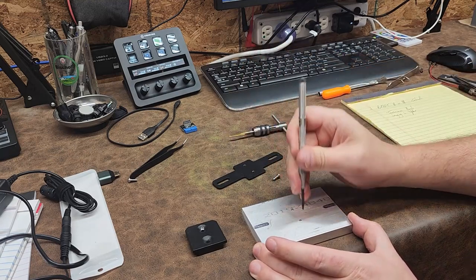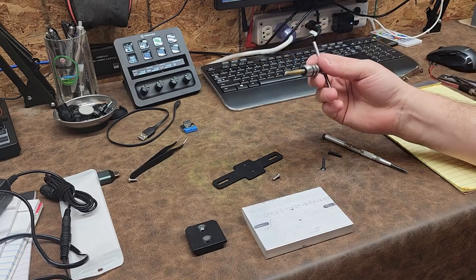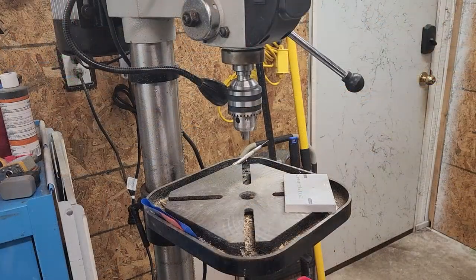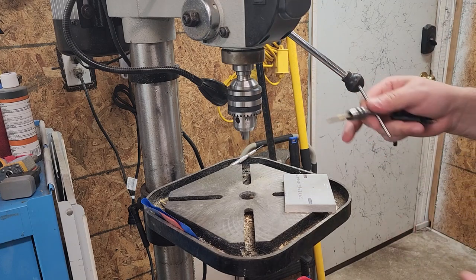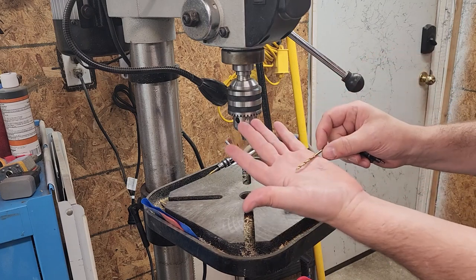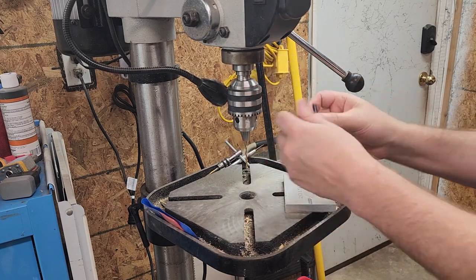There it is — we got it. Now we are ready to drill. Whenever you're drilling and tapping, your tap needs a very specific size drill bit, so we're going to look that up in the drill bit index. For the M4 by 0.7, the drill and tap chart says the most common equivalent is the one-eighth inch drill bit. So we're going to go ahead and mount up the one-eighth drill bit.